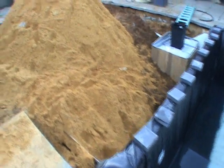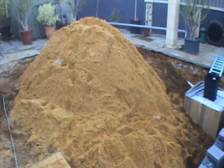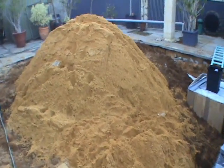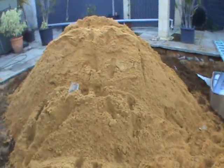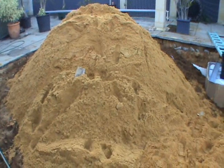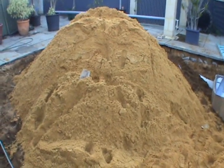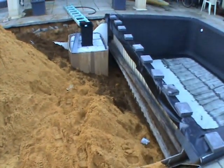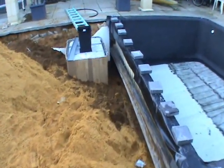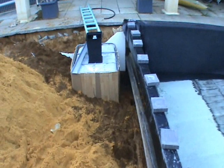You end up with about 25 to 30% compaction on clean fill sand. I've ordered 10 meters of dirt — I estimated I need about five, but I wanted about a 200mm overlay over the whole area, so hopefully that's going to be the perfect amount.